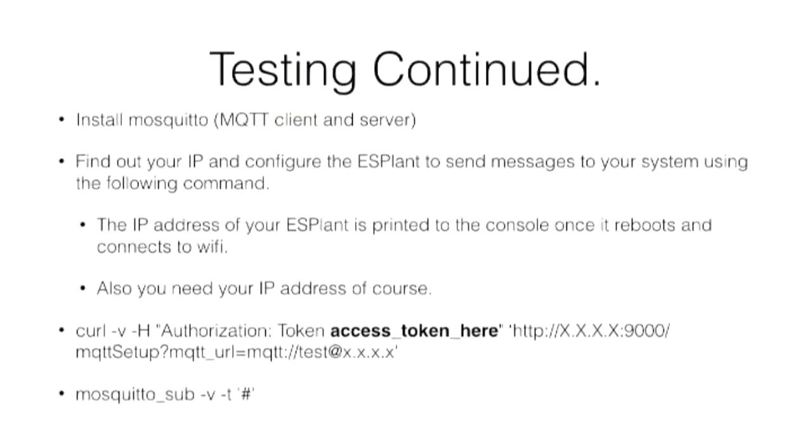If you're connecting to your local machine, you just use an IP address. And then effectively on your local machine, you use MosquittoSub — which is the client tool — to connect to the broker, which defaults to connecting to localhost. It outputs all of the values that you've got. So that's pretty much the two-step process: get it onto Wi-Fi, get it streaming data to your laptop. There are multiple MQTT services around that you can subscribe to, and you can set up Mosquitto on one of your own servers.